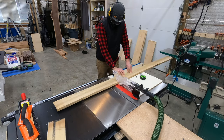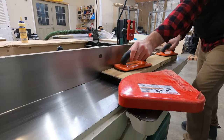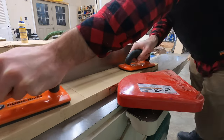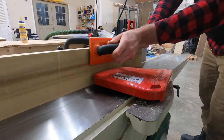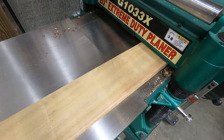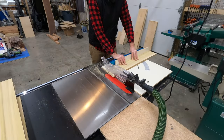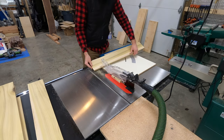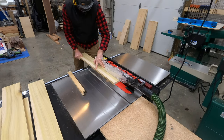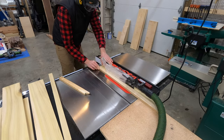With the cabinet frame assembled I put clamps across the joints on each side, and then while that glue was setting up I got started on the face frame. I'm using a rough sawn poplar board here, and the first thing you want to do with any rough sawn lumber before using it for face frames is to mill it up as close to perfectly square as you can. The typical milling process begins on the jointer where we joint one face then one edge, run the opposite side through the planer, and then with three sides squared up the boards can be ripped to the desired width.